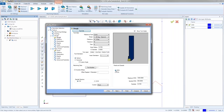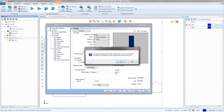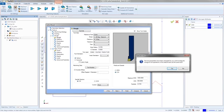of this. But just so you guys are aware, if you choose a drilling job, it will pick up the feeds and speeds. There is a material, it's just hidden right now under my stock. I got to expand that thing. It's probably still 1018 carbon steel because I don't think I've changed it yet. But the only time the turning section of BobCAD is going to use those feed rates and that material is when you tell it you're drilling or center drilling, all those kind of ops. So drilling primarily. Tapping.